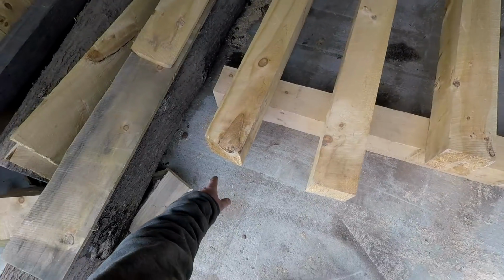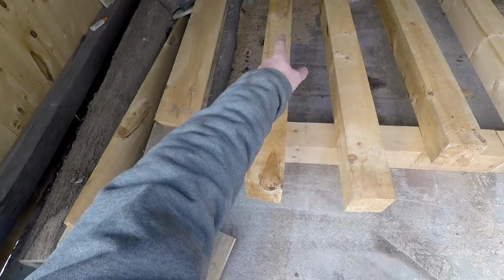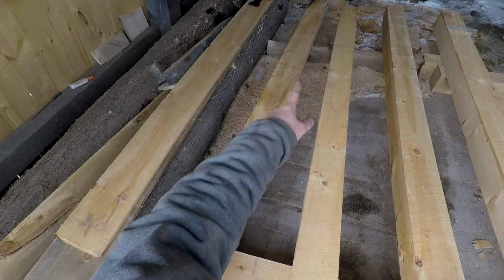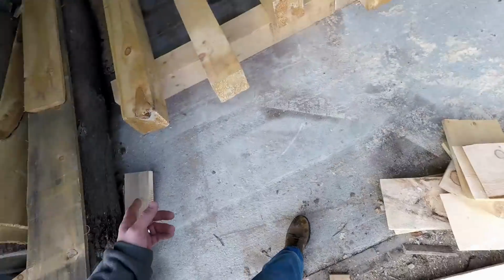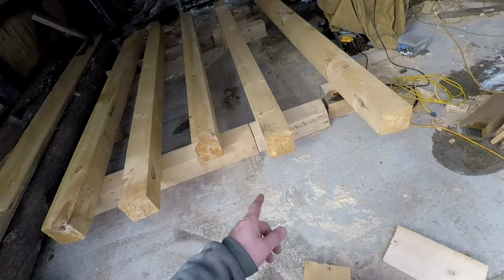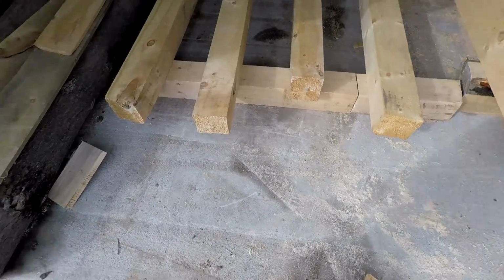This one's also a little bit cruddy, but it should be long enough to where we can avoid some of that. You could tell that log had a crown in it, because there's a little bit of grain run out towards the top of it there. But other than that, they're not too bad. That one, the heartwood's not boxed. That one is, and that one's close. But the 2 outside ones here, the heartwood is not boxed.